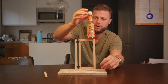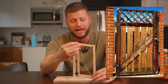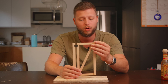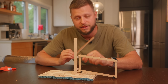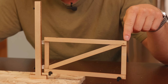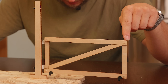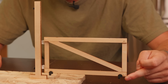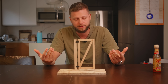So if your gate is currently sagging, this is probably your fix. They do sell cables that allow the brace to work in tension. Remember: when your wood is properly placed in compression you technically only need one or two screws just to hold it in place. This method still applies even if the gate is horizontally wider — even with pressure applied the gate won't sag as long as the diagonal is correct.